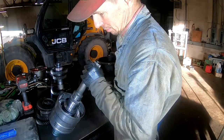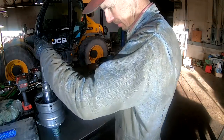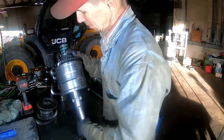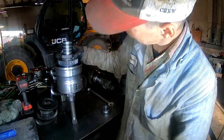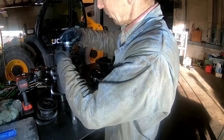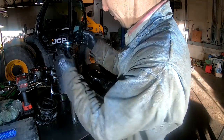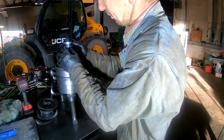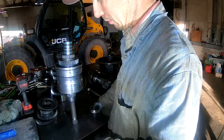So I'm kind of wondering if this clutch piston seal went bad. What's this other end going to look like? One end's going to be the high ratio, and obviously that's the high ratio, the one we were having problems with. These are scarf cut seals in here, which I can't get off because of my gloves. I'm going to get a pick or something and get in there.